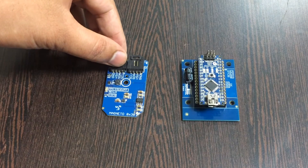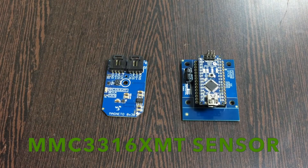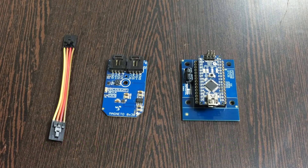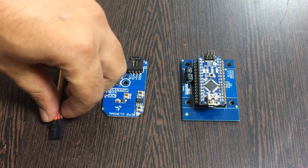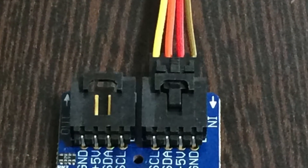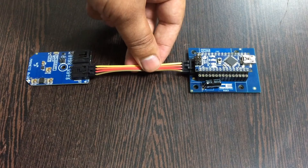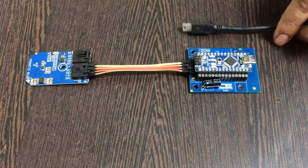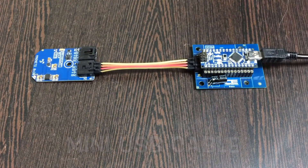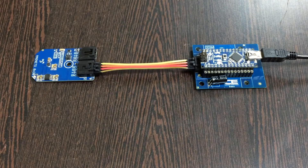The next part is the magnetic sensor MMC3316XMT. Here comes a connecting cable, which is very useful in making the connection. Make sure that the brown wire of the cable is connected to the ground terminal of the sensor, and the same goes for the I2C shield. The last part is to provide power, for which we require a mini USB cable — gently insert it into the power jack of the Arduino Nano, and we are done with the connections.